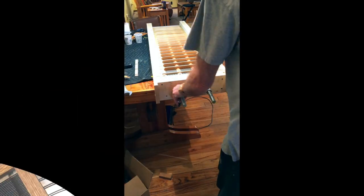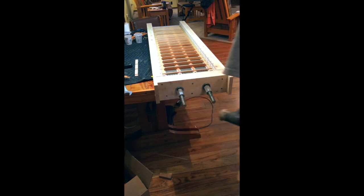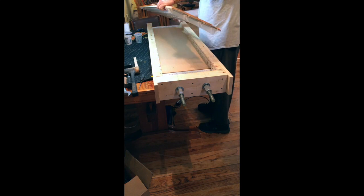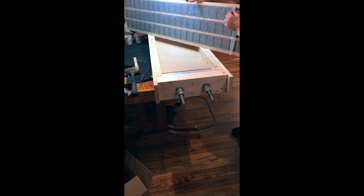Out here on the end, once we get the stator out of the jig we're going to glue on the end piece that's going to finally cover these wires. We've got to get it out of the jig first before we glue that down. I'm just going to loosen the bolts up and bump the plate forward. Here's our completed stator — you can see the wax paper peels right off. There's our stator: nice and clean, everything's flat. Beautiful.